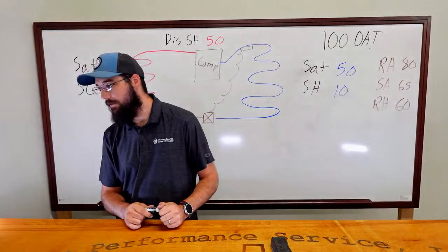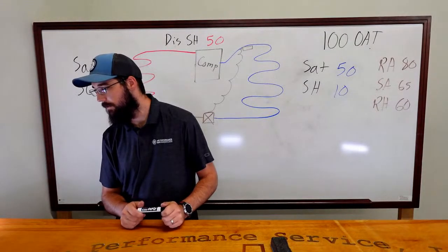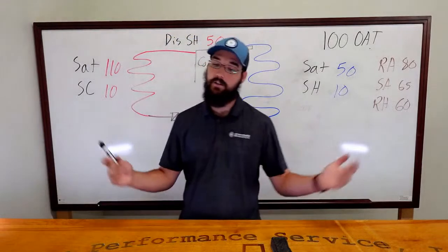Yep, back to work. Yeah, I got to wrap up here myself. I got some calls I got to run this afternoon, so keep an eye on the contactor if you want to see it pulled in. No compressor running. There's a hint. Yes, absolutely. Yep, your contactor's pulled.